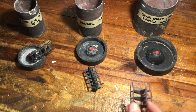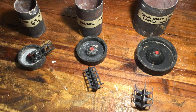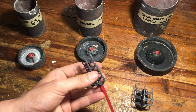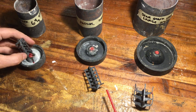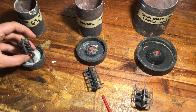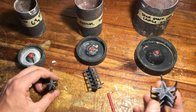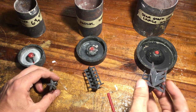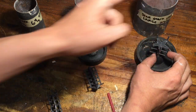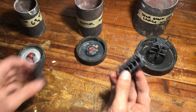Ultimately the question is how hard can you force the metal to go up and can you get it to force back? Your opening should be fairly large if you're going to feed in the point of the star direction. If you were to sprue it the other way, which would be totally reasonable, you could just bend all five points and stick them into the sprue base. We have the option to do both, but I think it would be most prudent to sprue to the point. This allows air bubbles to come out of the back of the star. We're going to do that with all three pieces with different tiered conformations to compare.